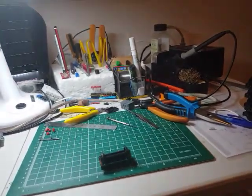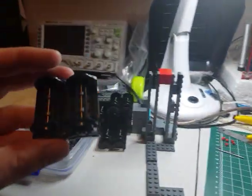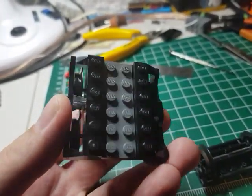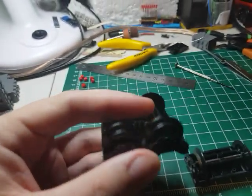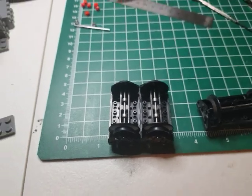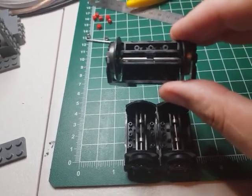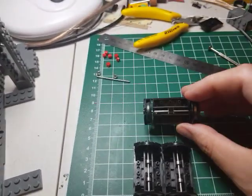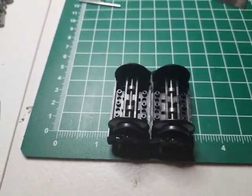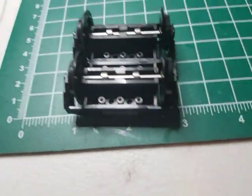That's what it takes to make roller bearings work, so if you're not into that, that's okay — this video is not for you. These bearings I've already made; I've done a batch of 50 axles so far, with another 50 to go. These are genuine Lego housings, but not genuine Lego wheels — the wheels and axles came from BrickTrax. I actually prefer these to genuine Lego axles. Genuine Lego axles are ever so slightly thicker by a fraction of a millimetre — you can't see it, but a micrometer will definitely confirm it. With BrickTrax axles, you can hand-press the bearings; you don't need any special equipment, you can just fiddle them on by hand, measure them up, slot them in.